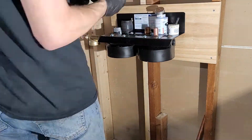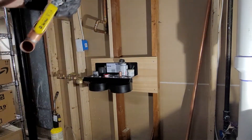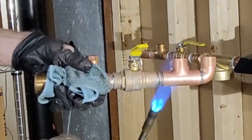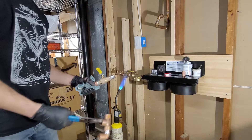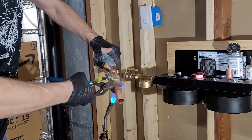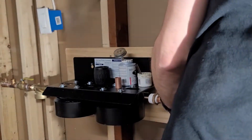I followed the rest of my blueprint and made the assembly for the right-hand side of the whole house filter — and I made an oopsie. Luckily there is an undo button for copper: wrap the assembly with a wet towel, heat the joint up sufficiently, and then use a pair of pliers to pry it apart. I made another mistake where I kept the ball valve shut while heating — this can distort the Teflon ring inside the ball valve. You also have to heat the joint to get old solder to flow before inserting a new pipe, then reseal with fresh solder.